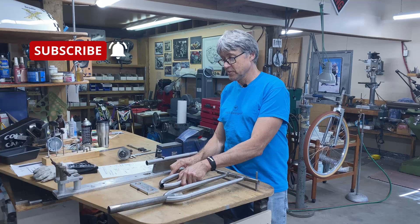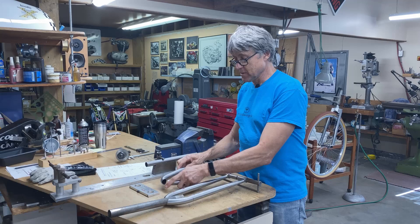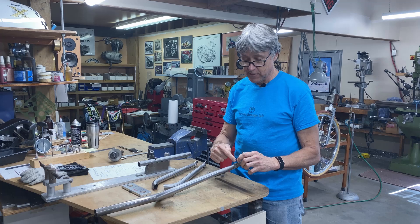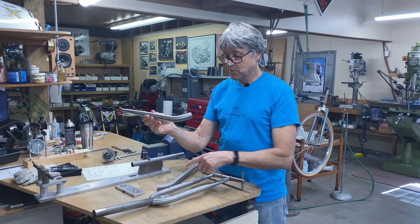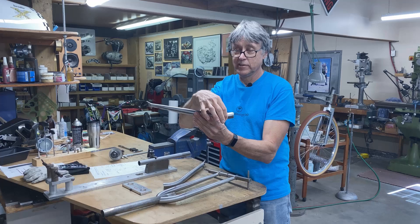This week I've been working on the jig because what I found is that it's very hard to miter these exactly where you want. Part of the problem is that I don't have a good supply of Shimano dropouts. I've got one style here and a different style here. They look the same but they're not quite the same, and what happens is in the jig we're holding it here and here, and in between the two different pairs of blades it changes the height in the jig right here, because it's very hard to hold here on a rounded tube. So we've got two different heights — and this is what happened.